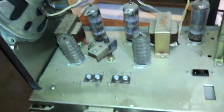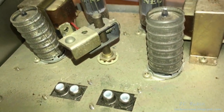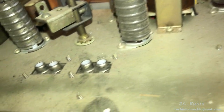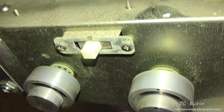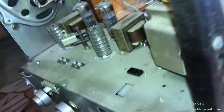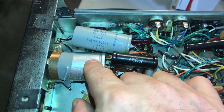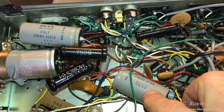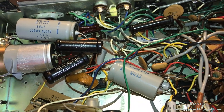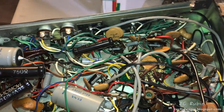With the unit separated from the wooden box, now we can get under it, blow it out with some air, clean the tubes. I think this shaft is the only thing that needs to be oiled mechanically, and I'll clean the switches. I've got some potentiometers here — maybe I'll see if I can get some DeoxIT at a Radio Shack. I'll also clean the tube sockets. The capacitors I found are: 40µF×350V, 40µF×300V, and a cathode bias cap that looks like 50µF×25V — that's all the electrolytics. I don't have an ESR meter so I'm not going to shotgun every single cap.